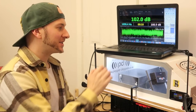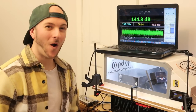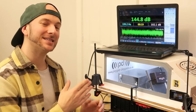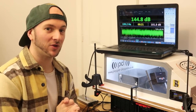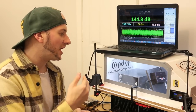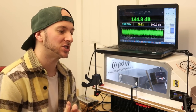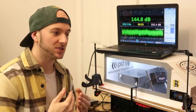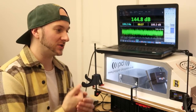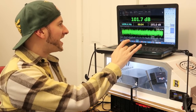Now it's a 198, which is 33 scaled hertz. Louder at the 33 scale. Interesting. So that is in between both tuning frequencies. And that's what I was saying a little bit earlier about playing a little bit above tuning can actually be louder than playing at tuning, just because you've got the displacement left from the port being loaded, but also the driver as well. Whereas at tuning, the driver is held very still, so you'd only get the displacement at the port. So yeah, pretty awesome. 144.8.